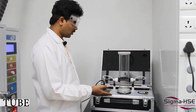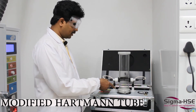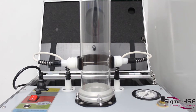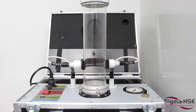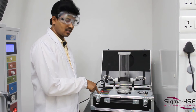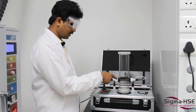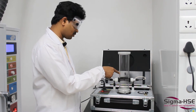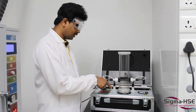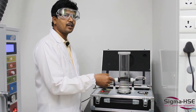This is the first equipment called the modified Hartmann tube. We have a one liter glass tube here. The sample material is placed in the sample chamber and gets dispersed in the air with the amount of pressure given from the pressure source. We also have a remote control system where, when operated, the material gets exposed to ignition created by the sparks of the electrodes. This determines whether the material present inside the glass tube is flammable or not, and this is divided into two groups: Group A and Group B.